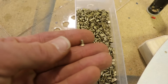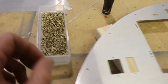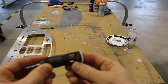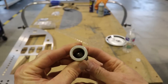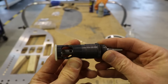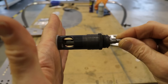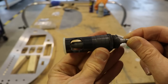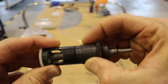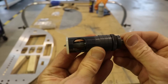I'm using these aluminum flush-mounted solid rivets — the ones I'm using here are the AD3-3.5s. The tool I'm going to use to countersink these holes is this countersinking tool. Inside here is a countersinking bit which actually cuts the countersink, and you can see this is kind of spring-loaded. You put this flush on your surface, this end where my right hand is goes into the drill, and you push down and that bit comes down and countersinks your hole. This is adjustable by loosening it and pulling it apart — that determines how far down the countersinking tool goes.